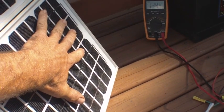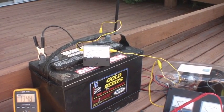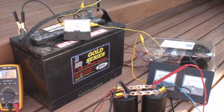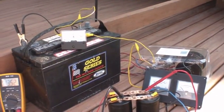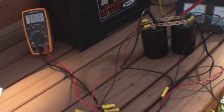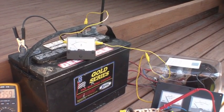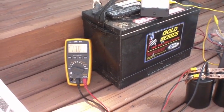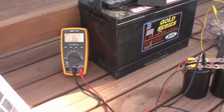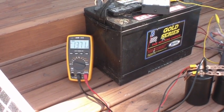So now I'm dropping my hand right across the solar panel. Yet I'm still charging. This is what you would call a partial shaded situation — I've got some shading from the tree up there, I got some shading from my hand. But the charging effect is still pretty darn reasonable. That's partially due to the capacitors — it smooths the function. So now that's my capacitor voltage. If I take my hand away, we do see that climb.